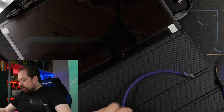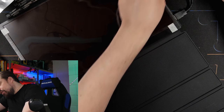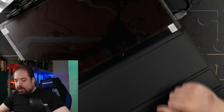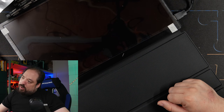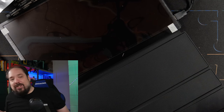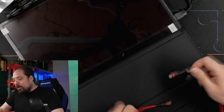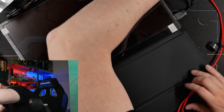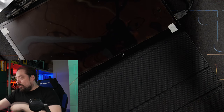But I should have a better cord here. Still won't give it, let's see, if we do this. Because I have a power supply here, which is a bit better. And then let's plug that in again. No, okay, it's drawing 1.3 amps, 2.8 amps. Wow, okay, yeah. So it's not getting enough power over USB. Okay, hold on just a second. Right, I had to dig out a USB-C to USB-C connector because, to be fair, it was delivered with a USB-C power supply. So it probably needs a higher voltage than the standard 5-volt USB-A will deliver to it.